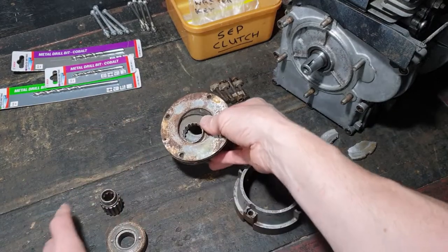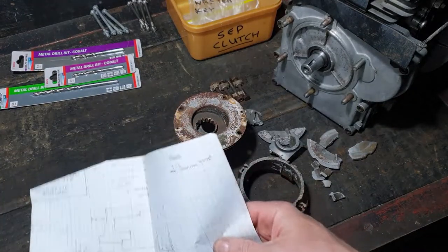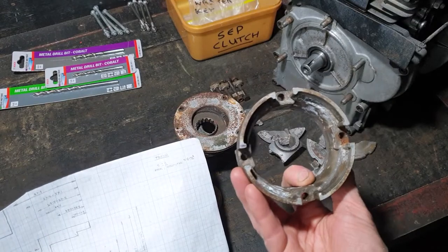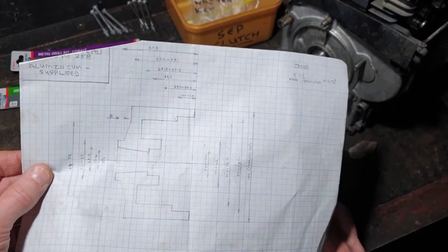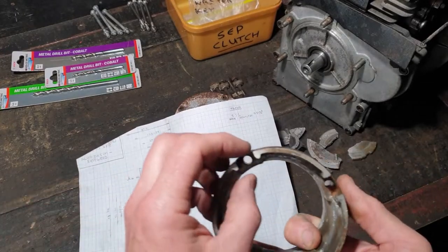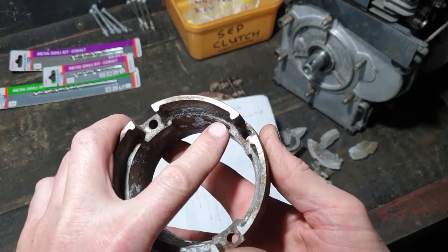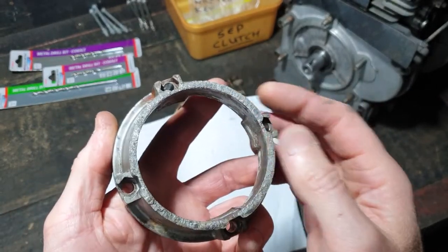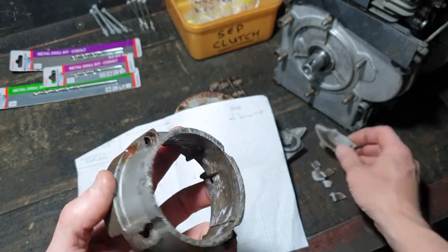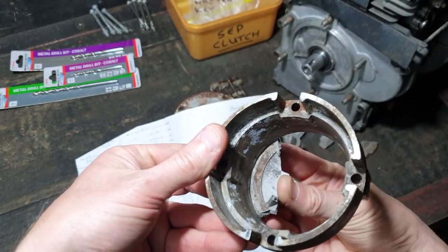Anyway, a couple of weeks ago, I finally got annoyed with it. So I got the micrometer out, measured up a whole pile of dimensions on this, and redesigned it. There's a whole pile of bits in this that have just been too over-optimized, made too thin. There's too many cutouts, and it's made of like 4mm junk die-cast alloy, and it just wasn't strong enough. And on this back corner, it just sheared off on the corner.